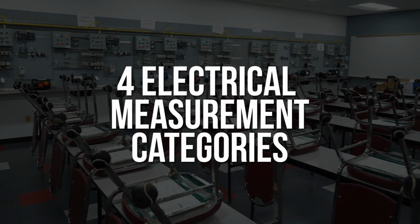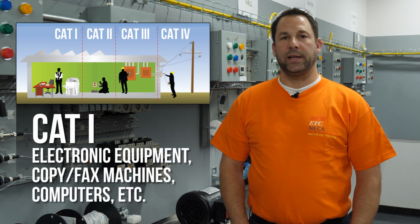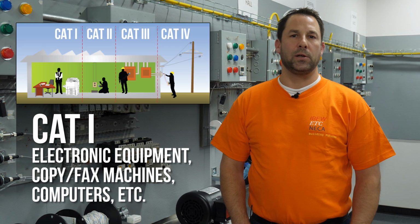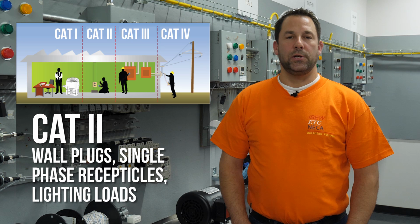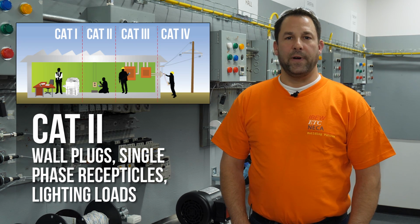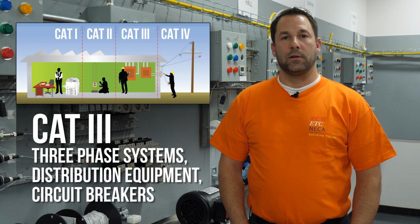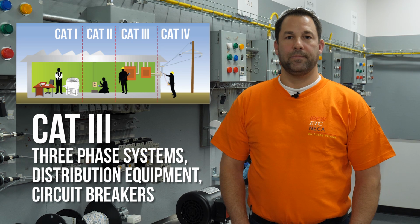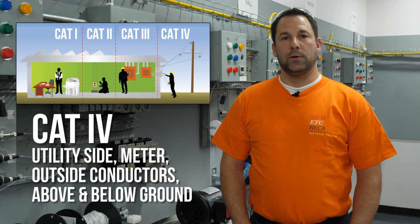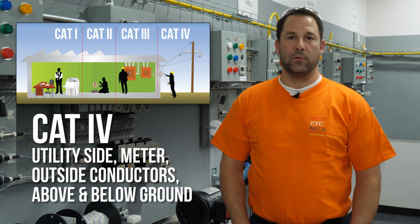There are 4 category ratings available for test equipment. Category 1 is essentially any type of electronic equipment, including computers, fax machines, copy machines, things like that. Category 2 would refer to single-phase receptacles and lighting loads. Category 3 would include 3-phase systems and the distribution equipment. Category 4 would include the utility side, including the meter and any other conductors found outside, both overhead and underground.